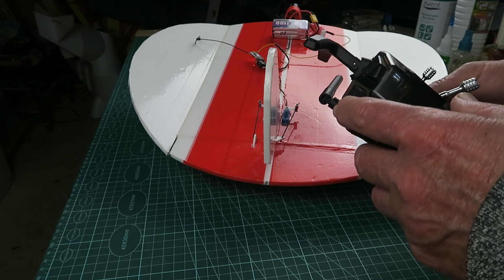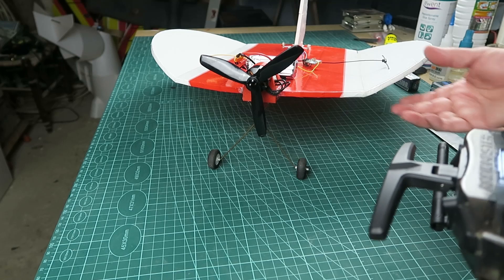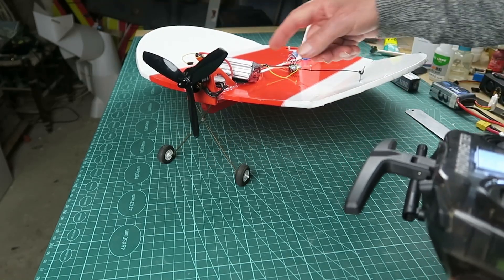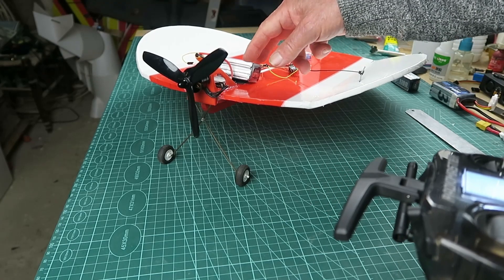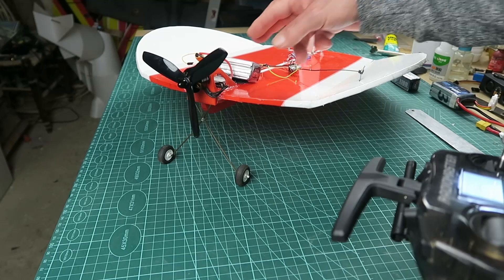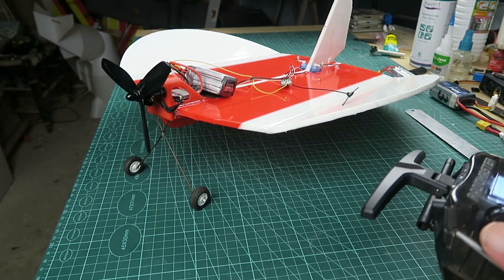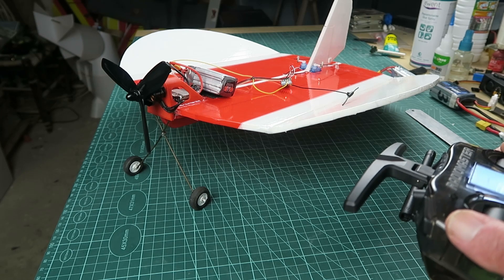On the momentary switch I have the battery voltage. You may think that 12.7 volts is quite high, but again, this is a high-volt pack. I actually tested it on my load tester at 4 amps and it gave 770 milliampere hours, so I'm quite happy with that. I've had good luck with these in the past. There we have it for the moment — I may try and jazz it up a bit with some graphics.